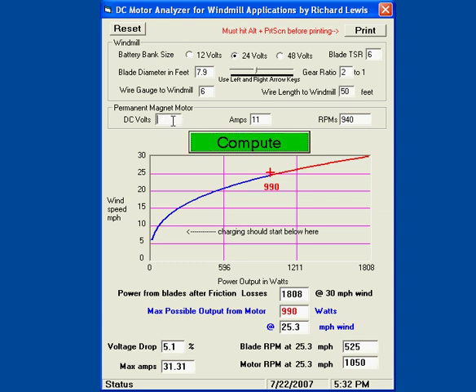Let's go with another motor — a treadmill motor. We'll go 130 volts, 11 amps, and 6,250 RPMs. We'll go 1 to 1 just to show you what it looks like. Well, it's way off the charts, as you can see.